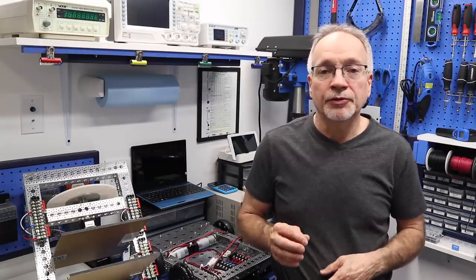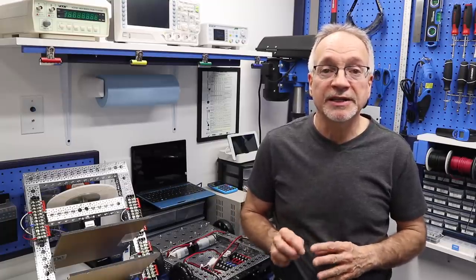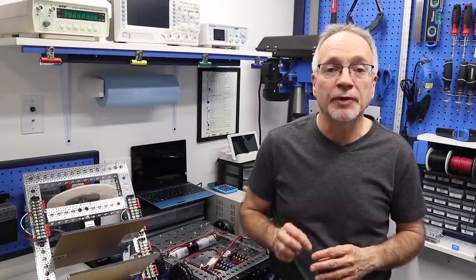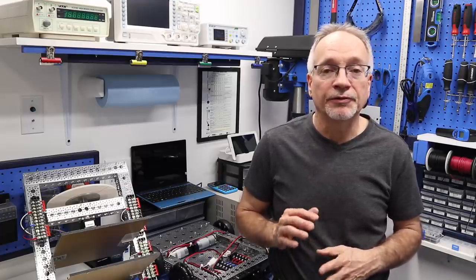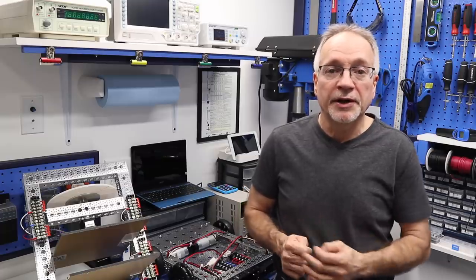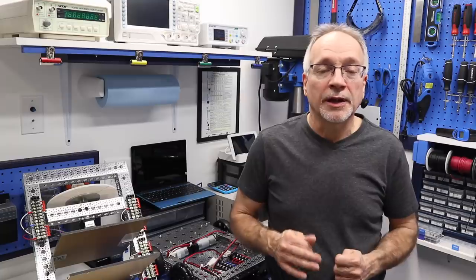At 9.2 amperes, if they're drawing that, we've got a lot of problems, and they should never actually get anywhere near 9.2 amperes. So what I intend to use is a 9 amp fast blow fuse. Now, I don't actually have a 9 amp fast blow fuse in stock, but I need to make a trip to my local electronics store.